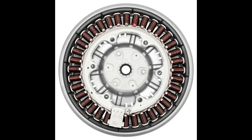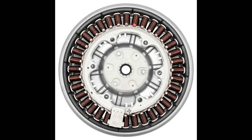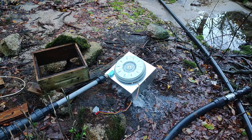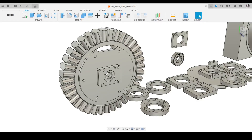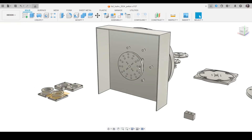After all the mistakes I made, I can recommend washing machine motors. But be careful — don't buy a normal induction motor. It has to be a brushless, or what they call an inverter-type motor, such as this one. The only challenge, if you are buying the rotor and stator separately, is to align the rotor and add bearings. The tolerance is very small — if the rotor touches the stator, it will end badly. I tried different bearing models to align the rotor to the stator, and I can give you the model I used in different generators I've sold. You can 3D print them or cast them in aluminium.